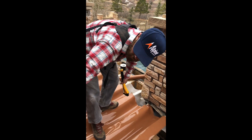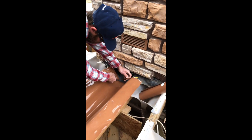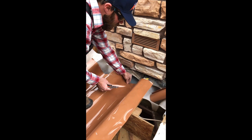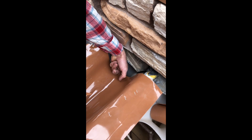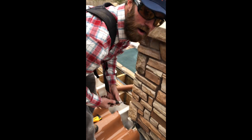There you go — you can look all the way down and see how it slowly drains all the way down. I'll come back and trim this back a little bit, and then right here in the middle make two slits and push that down, so any water that comes here trickles and drips down. If we don't do that, there's a chance water could soak back that way and get back in there. So we do that to make sure the water drips down.